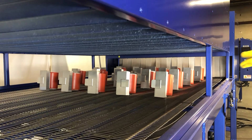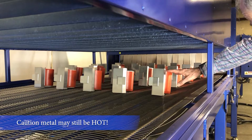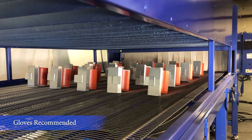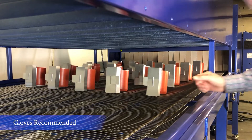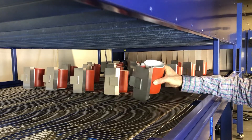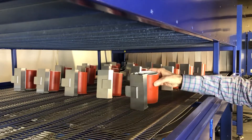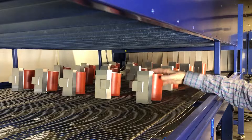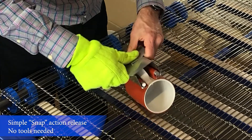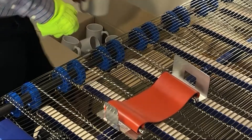The mugs are now progressing under the cooler. At this point they are almost lukewarm and almost ready to manipulate by hand — though some are still too hot to touch. By the way, these mugs travel handle-up. Some people put them the other way, but handle-up allows air to circulate inside the mug, which cools and also heats them a little faster. As you can see, the mugs at this point are cool to the touch. I use one glove just so the metal doesn't hurt my finger.